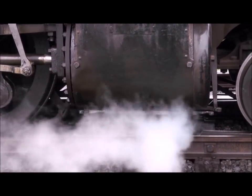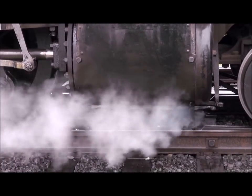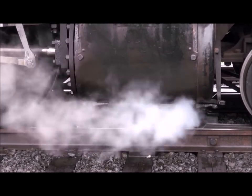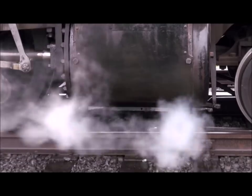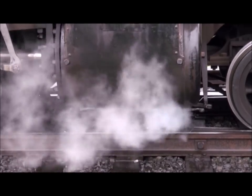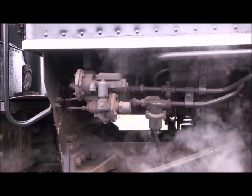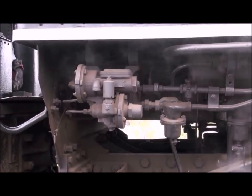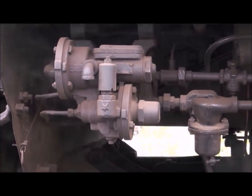You want to remember that steam is nothing more than a different state of water. Steam is ultimately compressible, where fluid water is not. You can get what's called a hydrostatic lock if you end up with fluid water in the pistons. So whenever we're sitting and whenever we're starting, we open these drains, which allows a little bit of steam and all of the fluid water to come out. That way we don't have to worry about blowing the end of the cylinder clean off. There is, of course, a braking system on the locomotive, and some of the valve gear to make the brakes work correctly. You don't have to understand all the bits and pieces, just understand how to operate it.